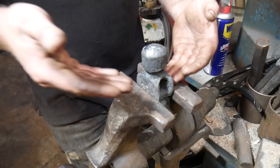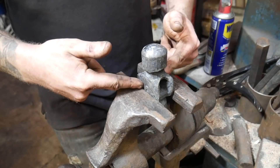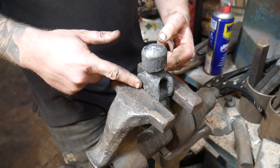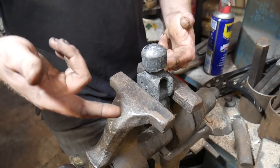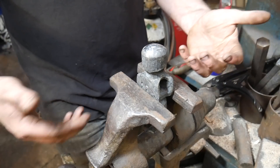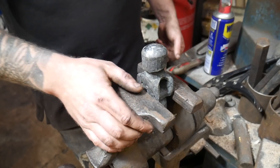What we're looking to do with a hammer is make it tough, strong, resistant to wear, and able to be used day in day out. We need to know how hard our material can get before we even heat treat it. C45 can only get up to 55 Rockwell, so it's not going to hold an edge very well or be the hardest thing on the planet, but it's going to be harder than the hot metal we're hitting and harder than most mild steels we use day to day. It should dent things and be a pretty good hammer, but it's not going to start destroying our anvils.